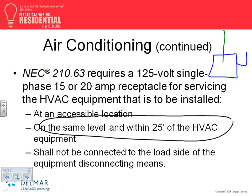What they do, guys, is they bring the power here to a fuse, and here's a neutral to the equipment. And you know what they do? They tap, they have a receptacle tied to it. They tap hot. Anybody seen that? Neutral. To meet this requirement for commercial projects, right next to the disconnect they tap from the line side of the disconnect and have a receptacle right there. So you disconnect the equipment, now this is completely dead. Lock it, tag it, and you still have power to plug in and work on this machine. That's a cheaper way of bringing a receptacle in a commercial building, rooftop units. Tap it.